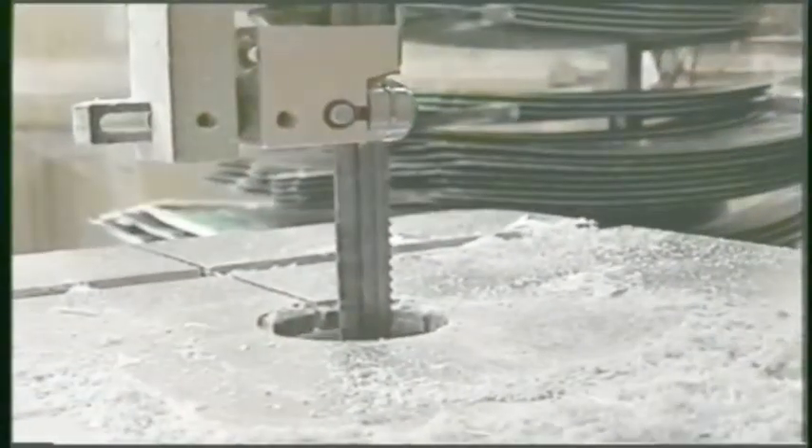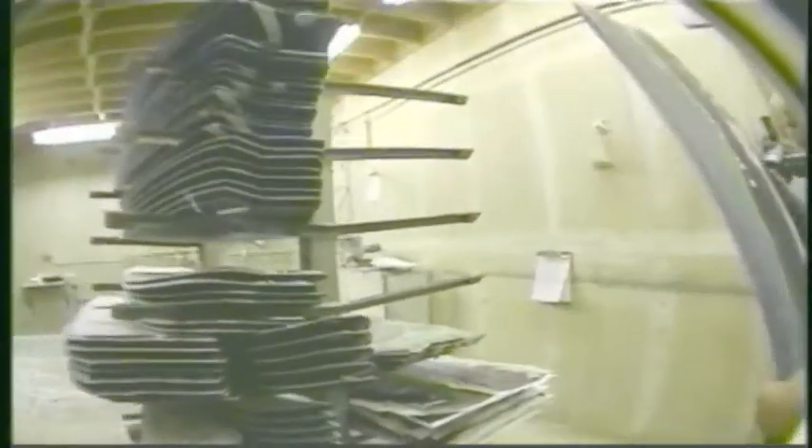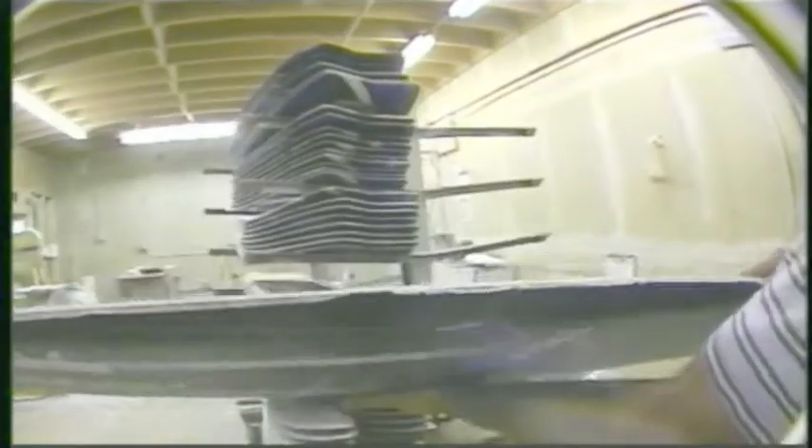The boards come out of the press room on racks and get pulled into here. During this process a guy will come by with a bandsaw and cut as close as he can to the actual edge of the wakeboard. This removes the larger amount of the flashing. You can see the edge of the board is just very close there. He trims it that close and then the actual tight close-to-the-pinch-line flashing will be done with files.